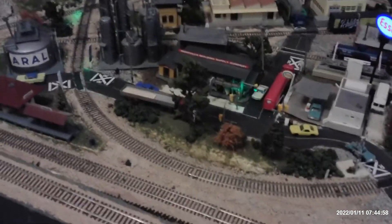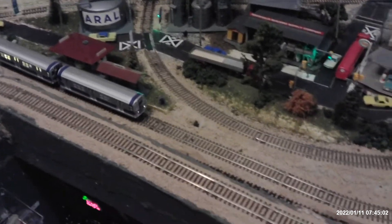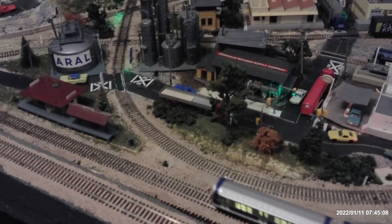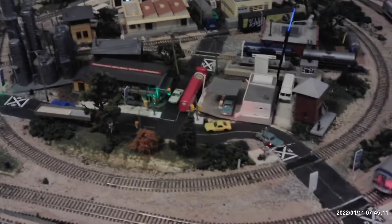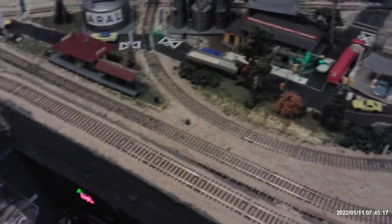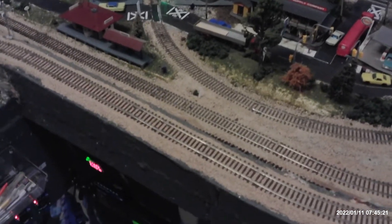I put my tester on there — I'll show you. This thing lights up, see how it's lit up? I had good 14-volt current on that track with the feeder. So I was playing around, and the BD-20 has a ground wire on it, and the other one's for the relay. It was just not working right. So when I put the ground wire on and ran new feeder wires to the BD-20, all of a sudden the LED on the AIU-01 came on and it stayed on.